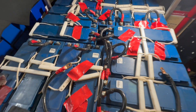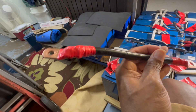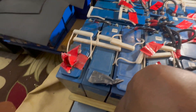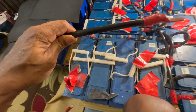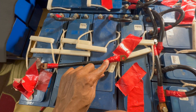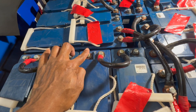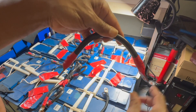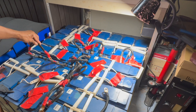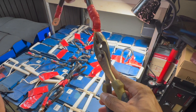I've got one wire — the positive wire — I have to straighten it out, then make an arch and bend it up to reach from this positive to this positive. I need to put the perfect arch so it goes from this positive to this positive without touching the negative. Then I've got to bend each of these straight like I'm doing right here.